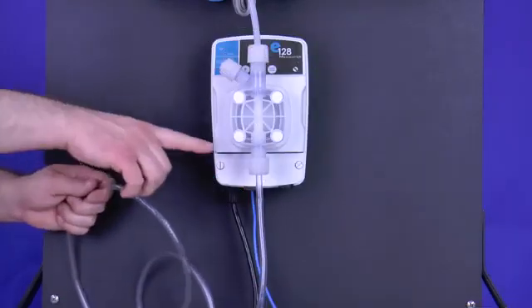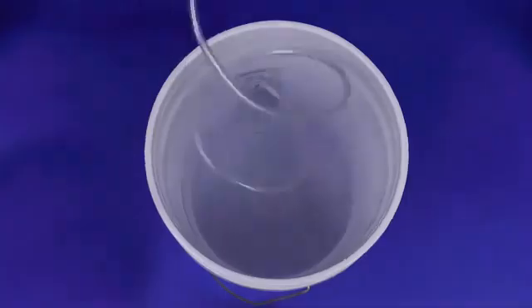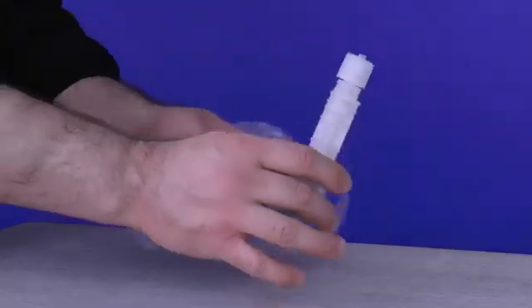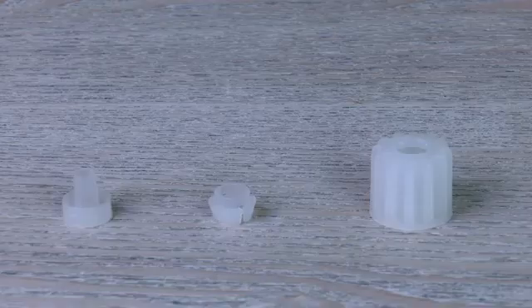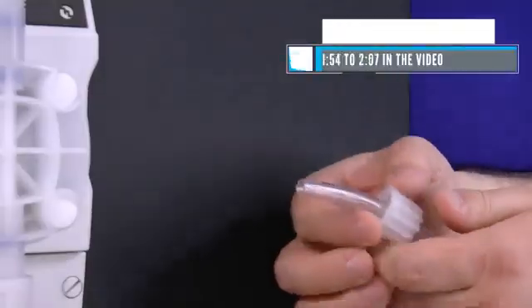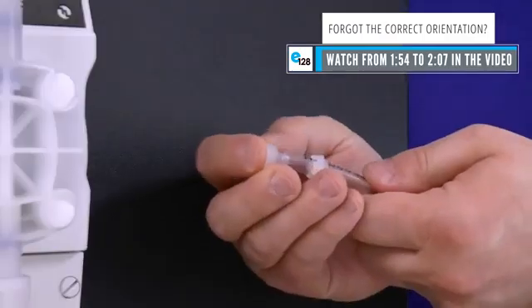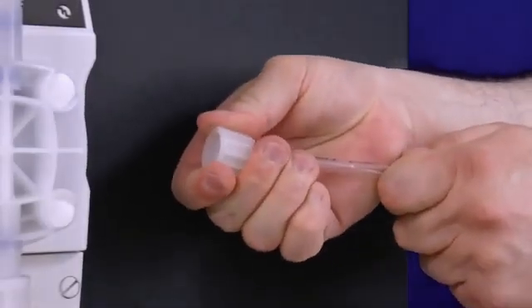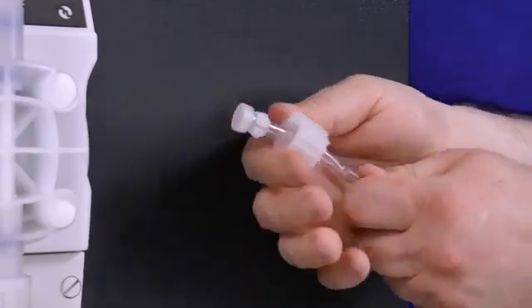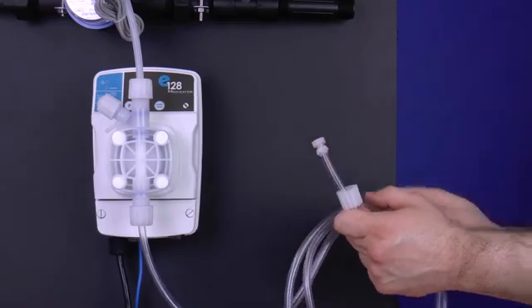Foot filter. Cut the PVC suction tubing connected to the suction valve so that the foot filter comfortably sits in the chemical bucket in a vertical position. Grab the foot filter from the installation kit and remove its tube nut, collar, and nozzle. Only hold onto the foot filter tube nut since you will need it for the next step — set everything else aside. Slide the tube connections onto the loose end of the PVC suction tubing, being mindful of orientation. Push the collar and nozzle together as close as possible. Pull the tube nut toward the nozzle to form a ferrule connection. Let the PVC suction tubing along with the foot filter tube nut, collar, and nozzle hang from the pump head.